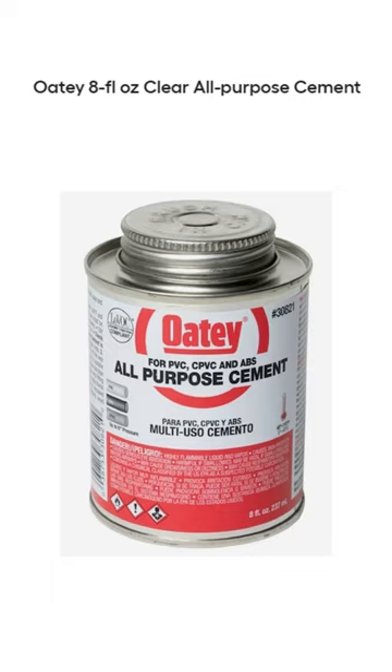So I had to jackhammer all this concrete and replace the pipe and fittings. And that's when I learned about the correct adhesive to use to join triple wall to PVC. Two years ago, I asked the Home Depot associate what adhesive to use to connect the triple wall pipe to the PVC fittings, and he recommended this all-purpose cement. I wish I had done some research back then and not trusted the associate.